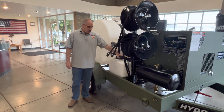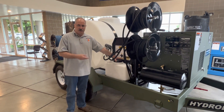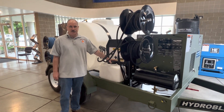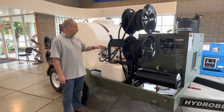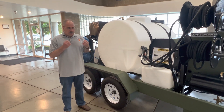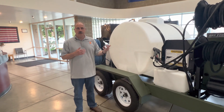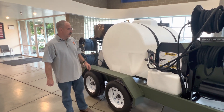We have a waste tank, which disallows any water to be discharged onto the ground. Should a temperature relief valve — a safety feature on the head of the pump — be engaged, this will capture the water or gas path coming off the head of the pump. The system is designed with operators to observe a 12-inch standoff with a 40-degree fan nozzle at a 35-degree down angle. That's proper procedure for washing the external side of the aircraft.